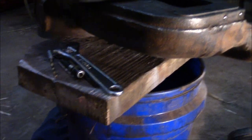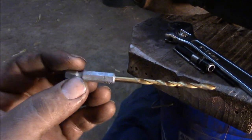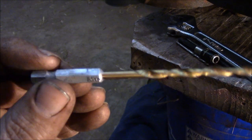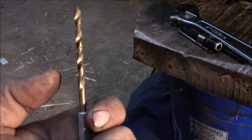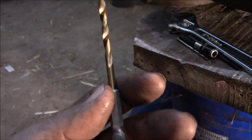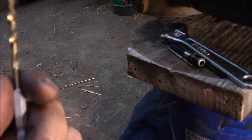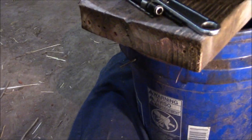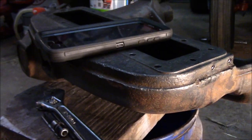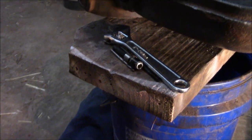I had to use these type of drill bits - I could use any one I wanted on this side, but on the other side I've got to use that extension, and this is the only way I could do it. Because some smaller ones - the little set screw comes in there, but these are so small. If you were to buy the ones without the piece here on the end, it would push it to one side and then it would be turning an oval shape, and you can't drill like that. I'm sure there's a better way to do it, but this is all I've got right now - the only way that I've found to do it.